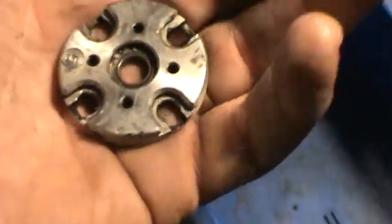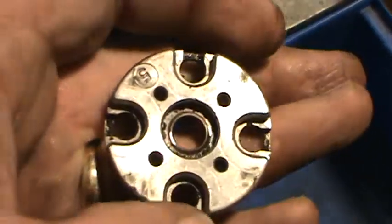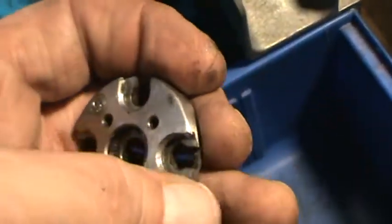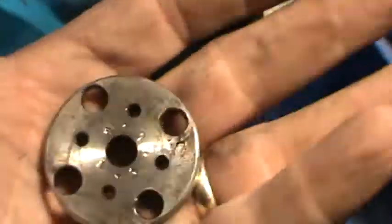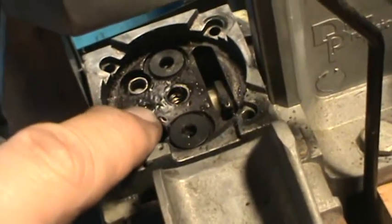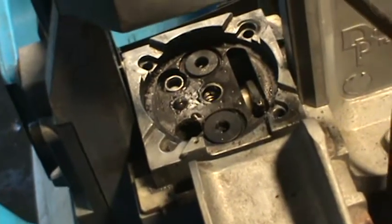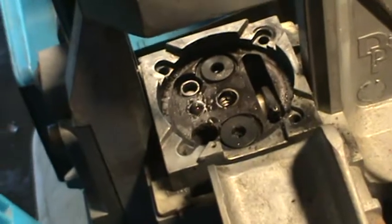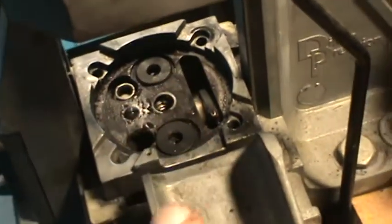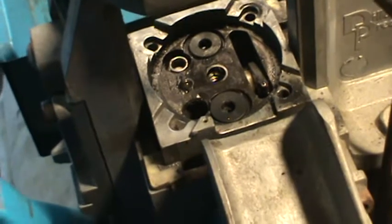To clean the shell plate, use a piece of wire to clean inside the grooves where the rim of the cartridge sits — scrub it down with a solvent and blow it off. I've got a magnetic screwdriver and I'll use it to capture the little ball and spring and take them out. Then I spray a little brake cleaner in there, scrub it with a toothbrush, and blow it all out with my air nozzle. Also check those screws with your Allen wrench to make sure they're snug.